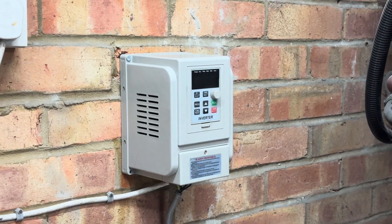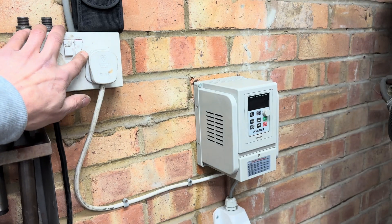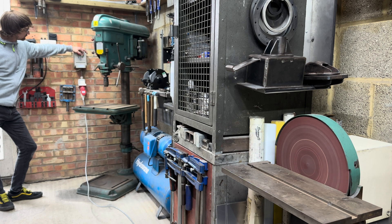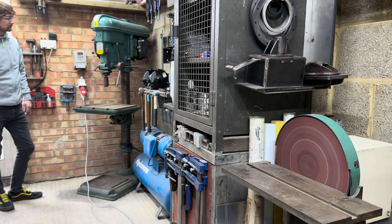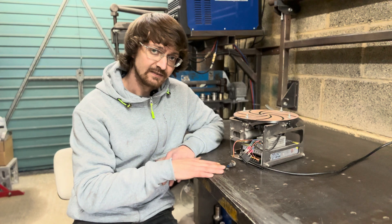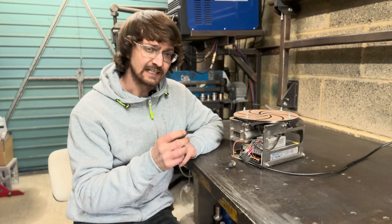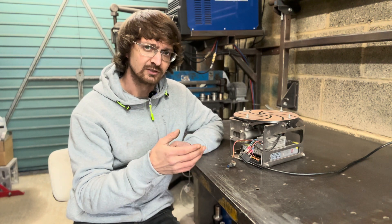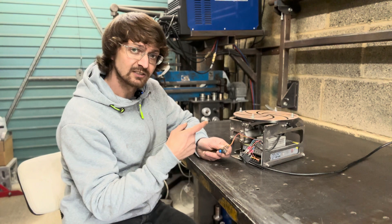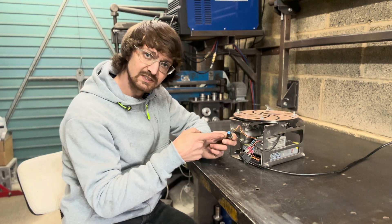And that is a VFD or Variable Frequency Drive. This magical little box takes our single 240-volt input and gives us a three-phase 220-volt output. This unit also provides control over the frequency at which our output phases are delivered and allows us to control the motor speed directly via a rotary switch. Just to make sure you guys don't confuse this — that is a VFD. This is a VSD or Variable Speed Drive. These are only used on DC motors and simply alter the voltage delivered to the motor as it's running, which in turn alters its speed. So we can go very slow, or we can go quite fast, simply via this potentiometer.